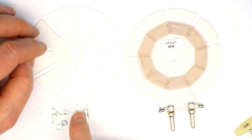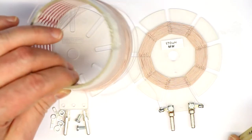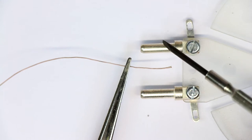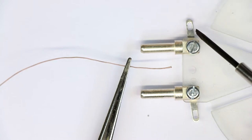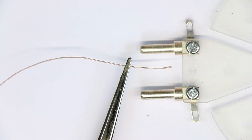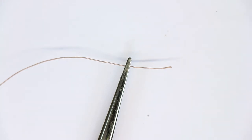The first thing you should do is fix the pins to the template. Now comes the important part: how you should wind the coil with the litz wire. After we put the banana terminals or plugs — fix them with a screw — and have the solder lugs or eyelets fixed, you should first put them in a horizontal position so later you can put some tension onto the winding by simply pulling it a bit downward.